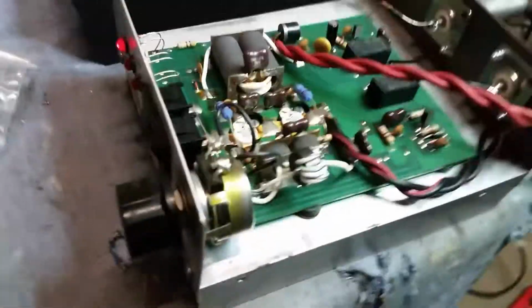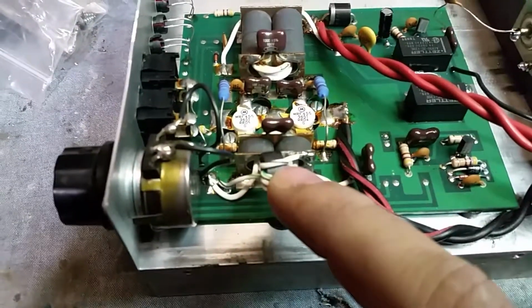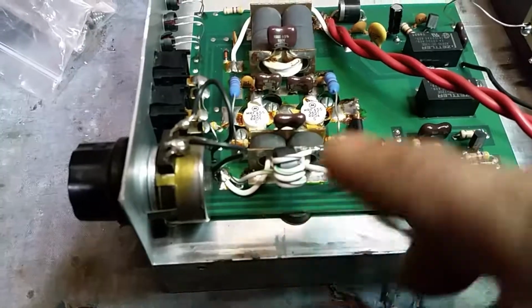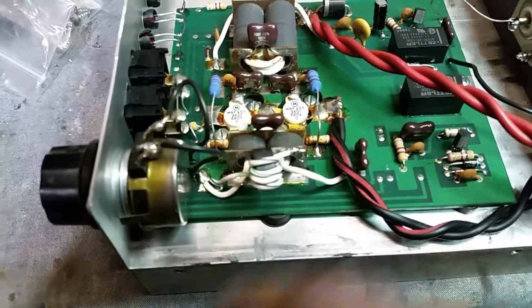And putting the choke on there, it did raise the dead key up just a bit, which is kind of unique. Well, no, it ain't unique. Thinking about it, one thing that would really make the dead key go up high is just straight grounding this with no RF choke. But so it did increase the dead key up a little bit, as you can see.